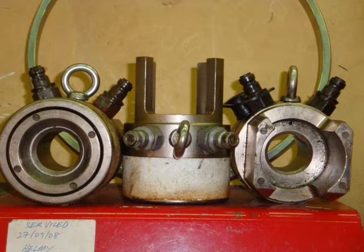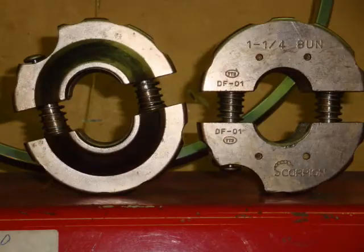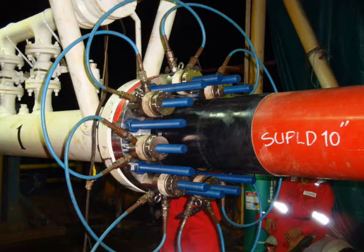Hydraulic jacks. To accommodate the hydraulic jacks, an extended portion of the stud bolt is required to pass through the hexagon nut, and the hydraulic jack is placed over the bolt to be tightened. Reaction nut. The reaction nut is then screwed onto the portion of stud bolt protruding through the hydraulic jack. When brought into contact with the hydraulic jack, the reaction nut retains the hydraulic jack on the bolt. Hydraulic whips are connected to the hydraulic jacks in a ring main circuit and are in turn connected to a hydraulic pump unit, and oil is pumped at high pressure into the hydraulic jacks.